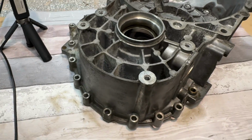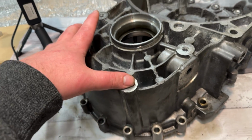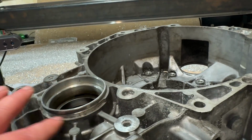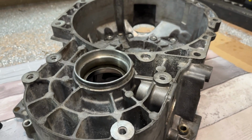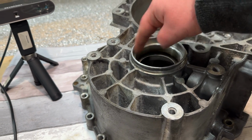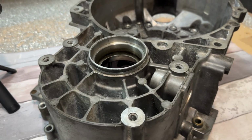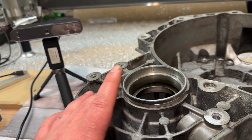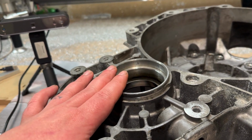What I think I'm going to do with this is run the original seal. The plate, obviously it's going to have to stand off to clear sort of these areas. So that's going to be stood off. We're going to have a protrusion out of the back of it that's going to seal on the original sealing area in there. Then on the top of that, I think it's about 4.5 mil that I measured from the top of here is where the new seal is going to start.